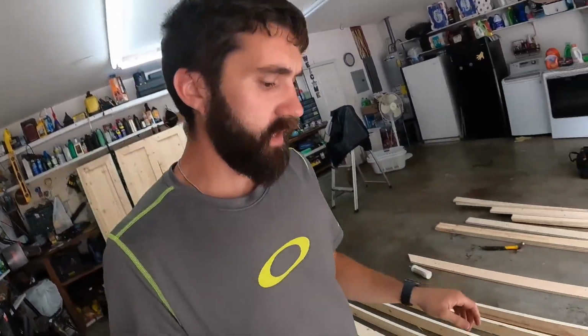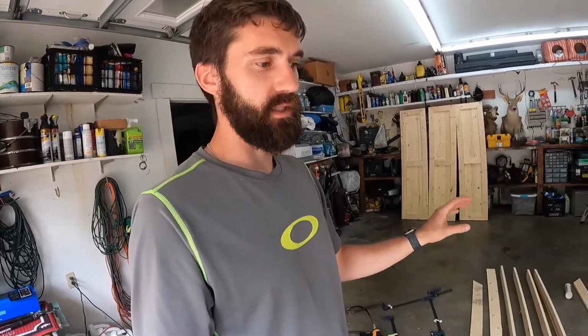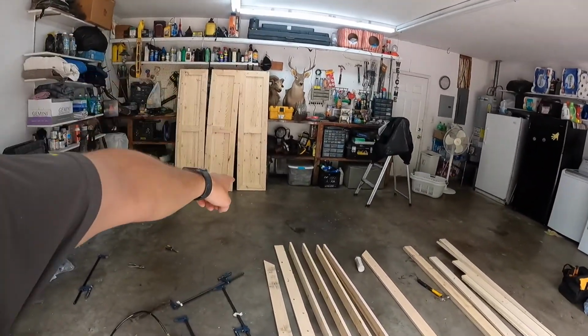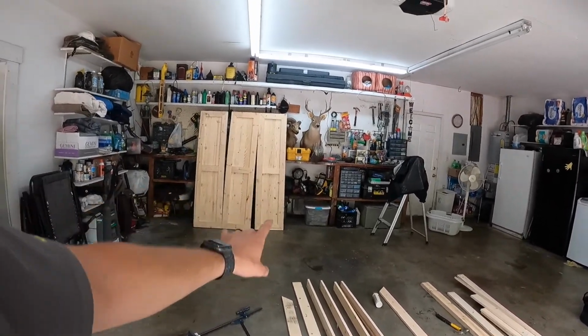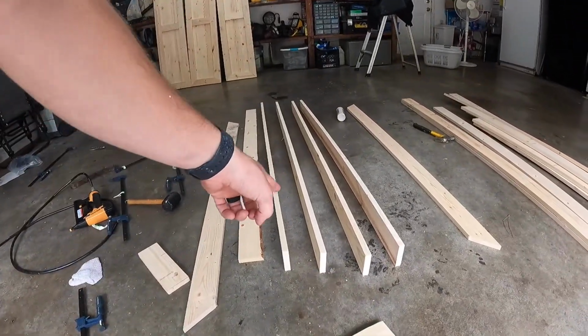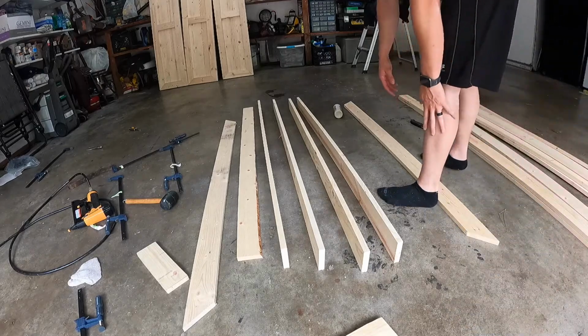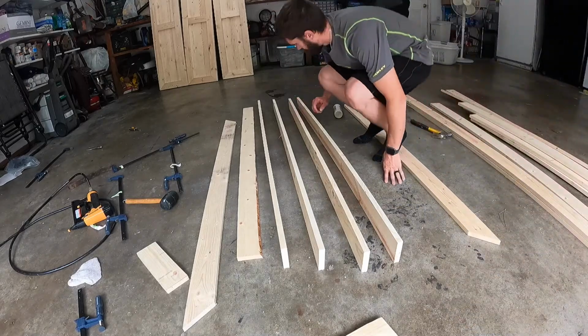I was pre-cutting these boards at 10.5, and I found that we're varying about a 1/16 of an inch on all these. So I've been staging them up, getting the outsides I know are 6 foot because I'm cutting them at 6 foot. So I'll get the long ones, and then the ones top, bottom, and middle, I'll figure what they need to be after I've done it. So I'll just do one of these. I've already cut the 6 foot boards and the outside with the 45s 6 foot boards. So I'll just kind of do a start to finish on one of them.